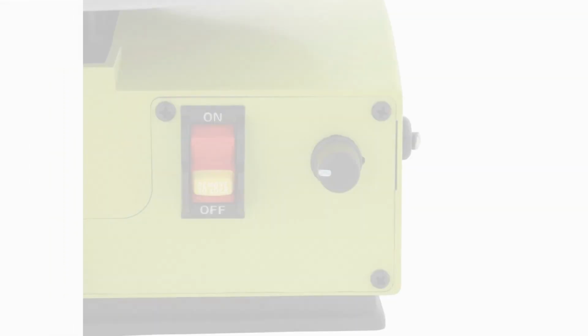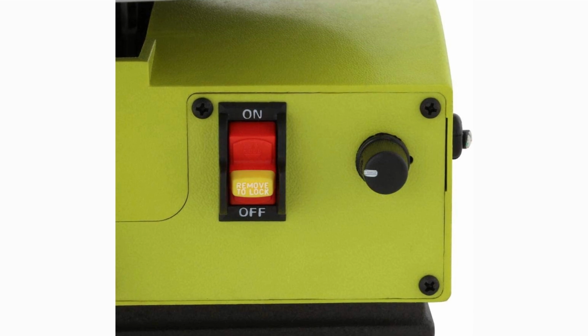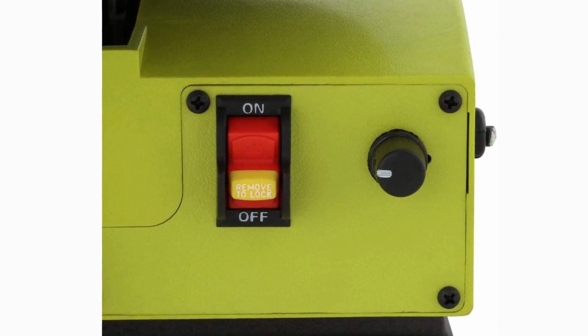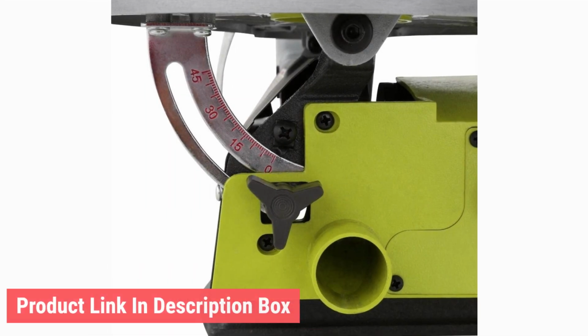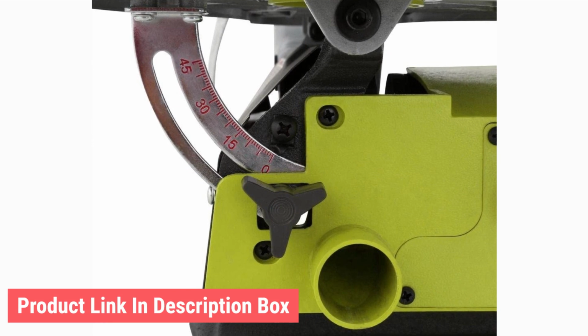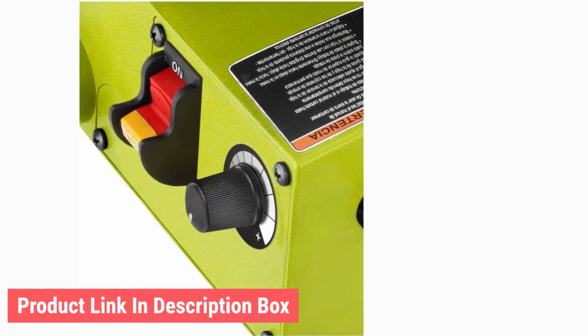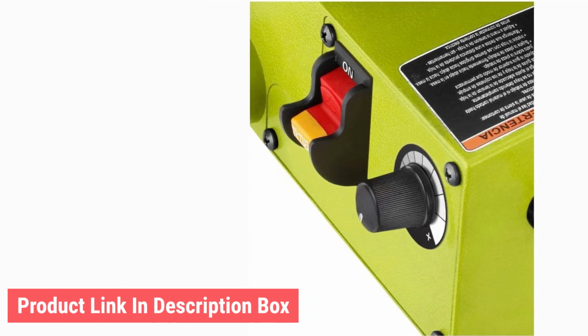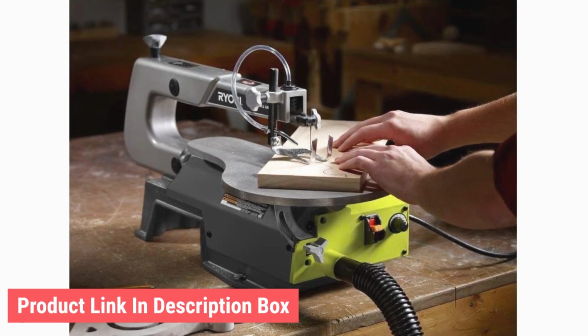This model features a 16-inch throat and tool-free blade changes to make life easier. A cast aluminum tilting table can be set between 0 and -45 degrees, which is useful for beveled projects like inlays and bowls. The machine also accepts either pinned or pinless blades, depending on your preference. A cast iron base supports the saw and minimizes machine movement, although you'll still have to deal with some vibration.